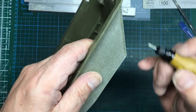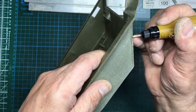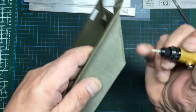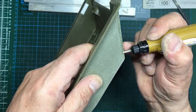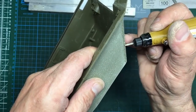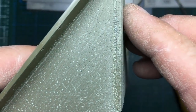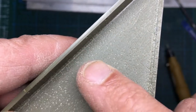There we go — you've got a kind of rough look. If you want to go a bit deeper, just go over it again. The main thing is not to let the tool go sideways, because you're trying to make grooves rather than grinding the surface. It's nothing like the German stuff. That's the kind of look we're after for the end of that steel plate — you can see the pitting of the hot rolled steel, and then you've got the weld which I did before.